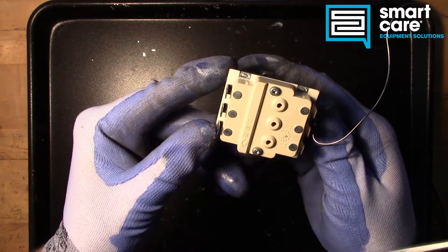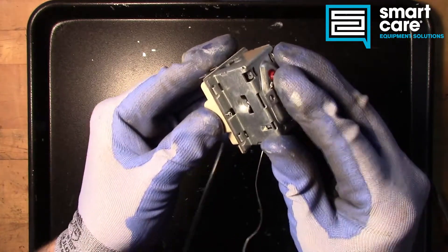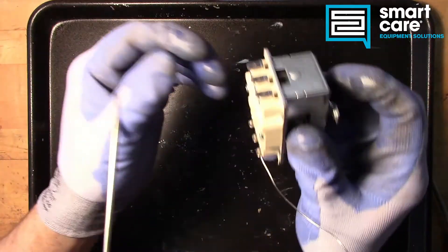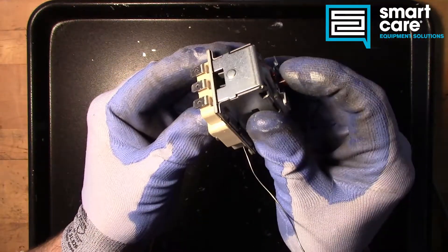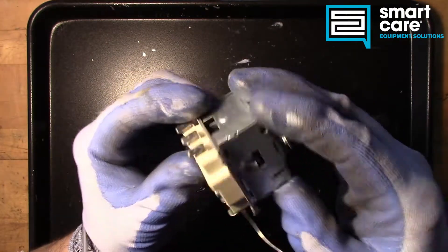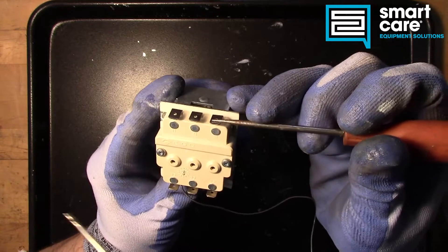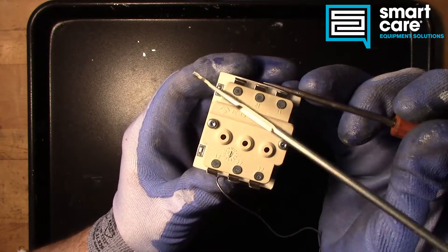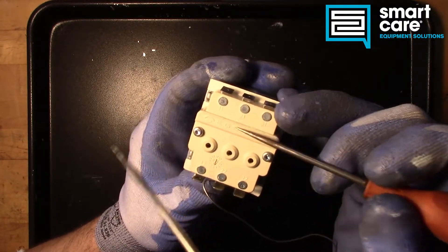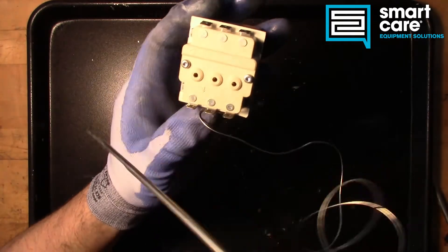There are a couple things to talk about with this. The first is that these can trip on impact — there's a mechanical plate in here, and you can trip these just from impact. So if you hit it a particular way... yeah, there it went. The other thing is you've got electrical circuits going from top to bottom. Terminal 31 connects to 32, 21 connects to 22, and 11 connects to 12. You can get two of the three legs resetting and the third leg hanging up, losing one of your circuit paths — and that can be one of the ways these fail.